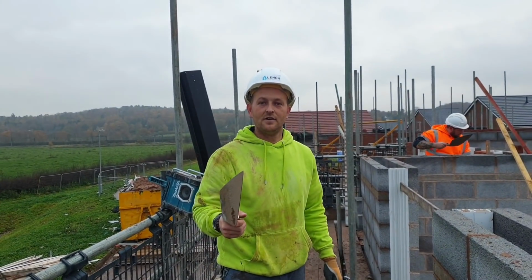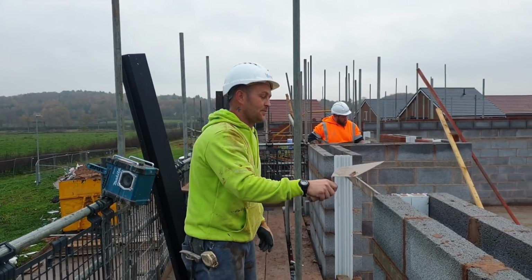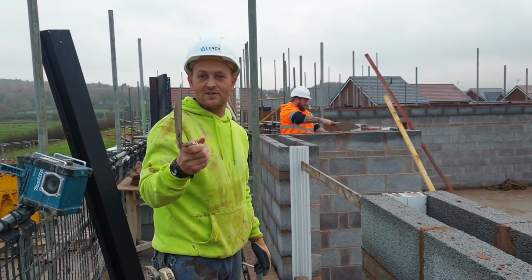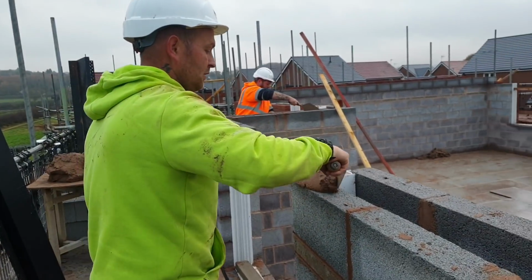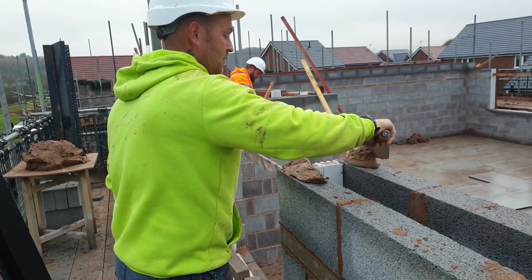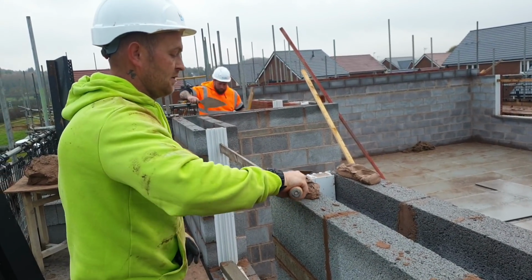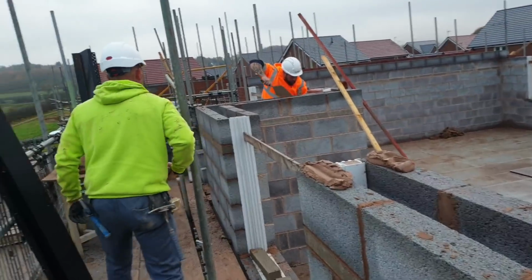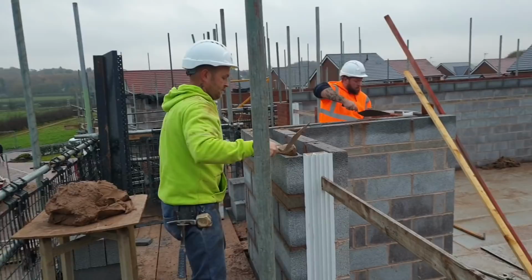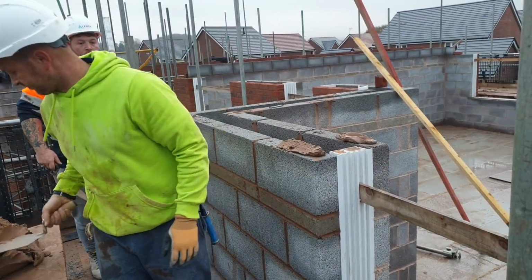Hey up Changs, right, I'm Ian, this is Chell Brickwork. And today we're going to be showing the apprentice, new lad Brandon. He's holding the camera now, I don't know if he wants to get on it. But we're going to do lintels. First off, put a bed on both sides. Don't need a lot on. Get that bed on there.